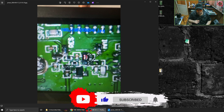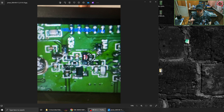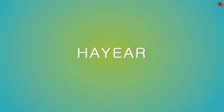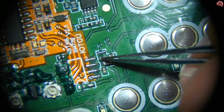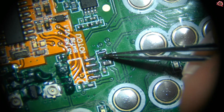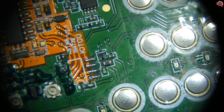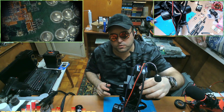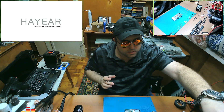For this mod, if you're going to get this one, I would also advise making it louder. Let me show you — just one jumper you have to do and that's it. You see: audio-in left and right — one resistor here and another one here. You make a jumper over one of these resistors, either here or here, and that way version one is going to be louder. This also applies for version two — with the preamp, I also have this jumper, and it makes it extremely loud.